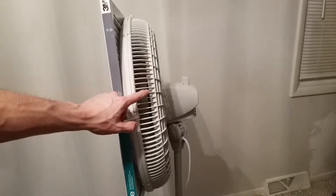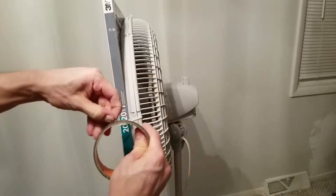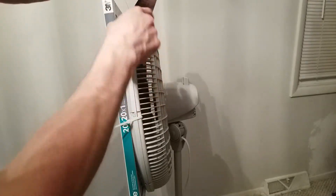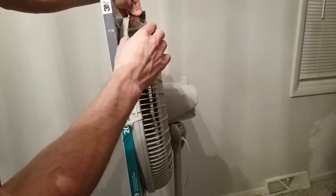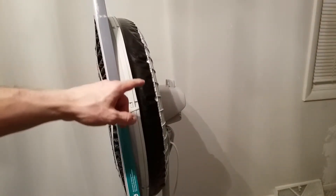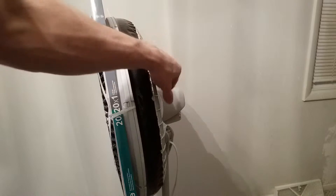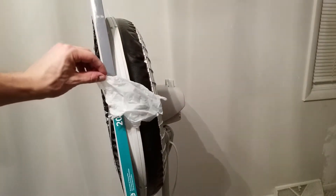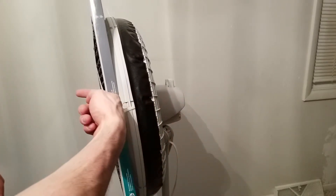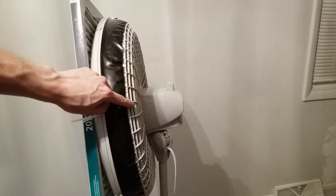So now we're going to tape up right here to hopefully seal it. If it was leaking air, get your duct tape and simply wrap it all the way around the edge. Now that the fan is sealed, we're going to retest with the bag to see if any air is still escaping. As you can see, the air is not blowing away — it's immediately sucking it in, so you know air is going through the filter. If air is still blowing out, just put another layer of tape right here.